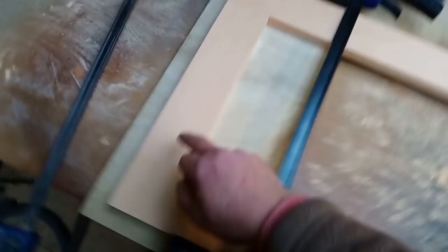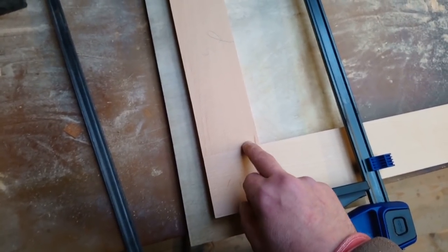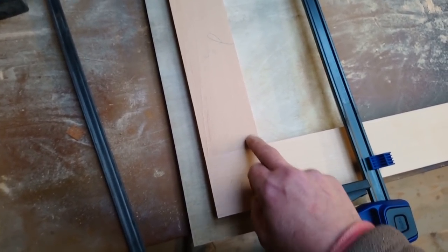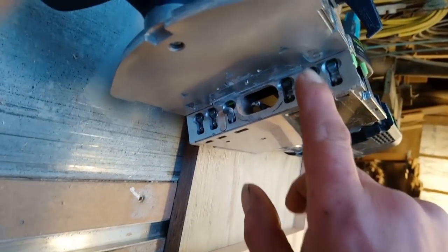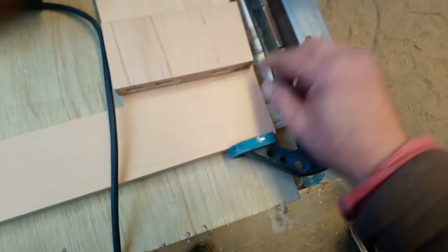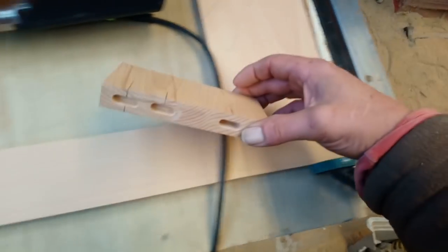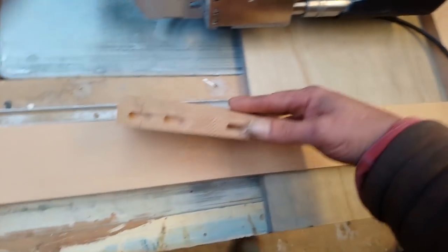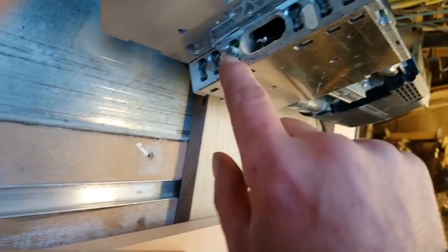That's why I made these 80mm. Because I know from the past that 70-75mm, you're just too close to this groove. Right, so on the machine, that is the second pin, or the middle pin, that one, which I'll do for the bottoms. Like I say, it gives me a little bit of clearance, stops the bottom breaking out. And then this one is this first pin, this one.